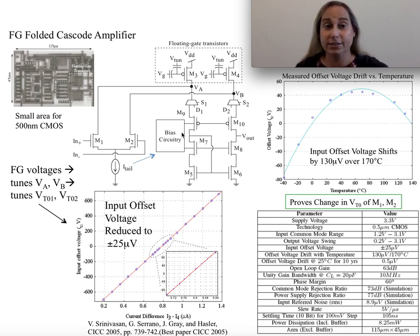All of this looks like a very traditional form — two NFETs. These NFETs, M1 and M2, are the core structure sitting there. One of the big problems you run into is that there's usually some threshold voltage mismatch between those two devices. The rest of the circuit is biased by two current sources biasing everything up here.